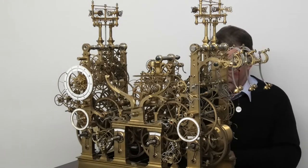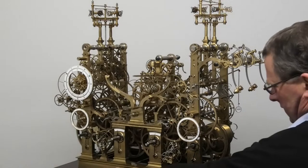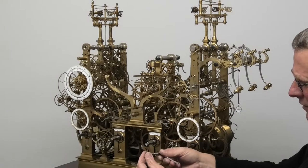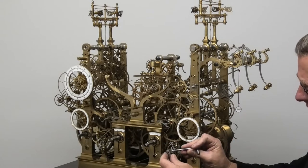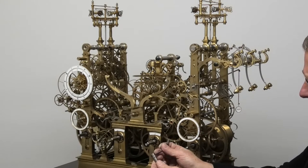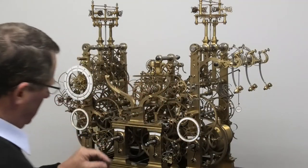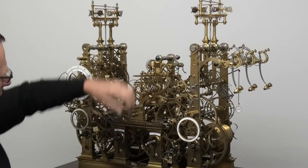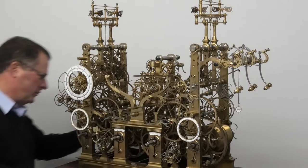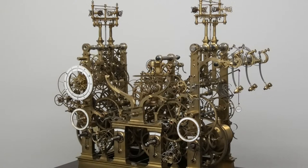It is a Tommy bar bolt, and the same tool that we use for tightening the eccentric clamps. The bar at the bottom is used to tighten or loosen the lower clamp screw. It's inserted through the lower lug on the center frame. So now we have the four clamps and the center bolt loose. The frame can now be lifted up.